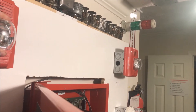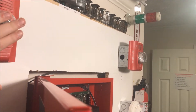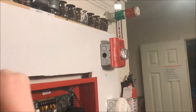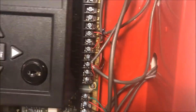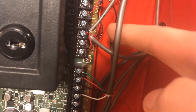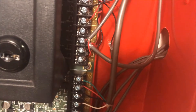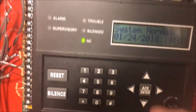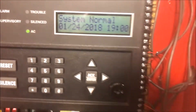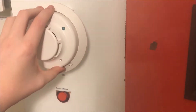NAC 3 is my trouble NAC. Here is NAC 3 right there — it goes up through my panel and over to the trouble light. To get it to flash, I coded my panel through March time, because my panel does a slower March time. So if my panel ever goes into trouble, like say a missing detector, the panel will blink trouble and the light will begin to flash.